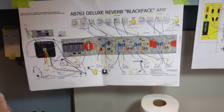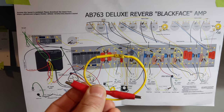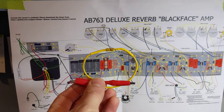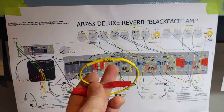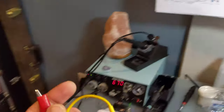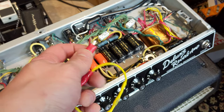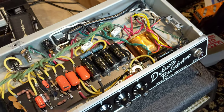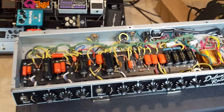Because the power supply section is built around vintage design with no discharge resistors built in, you're going to want to watch my other video on how to discharge capacitors. This is my discharge device I built, because this voltage will linger. I had this amp unplugged for more than 12 hours and the capacitor was still sitting at 200-something volts. So you're definitely going to want to watch that video, create one of these yourself, check out that layout, research it, read about it.